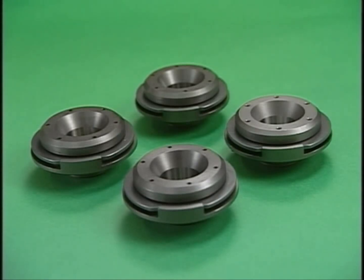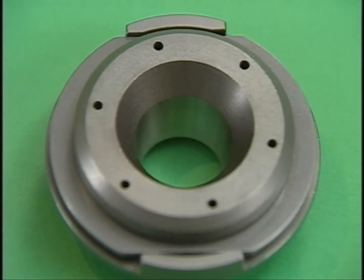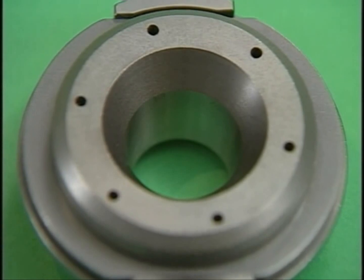Improper rotation of the valve rotator will cause carbon to become trapped in the valve seat. This can cause valve seat blow-by and shorten the service life of the valve and valve seat. Consequently, you should periodically overhaul and check the valve rotator.